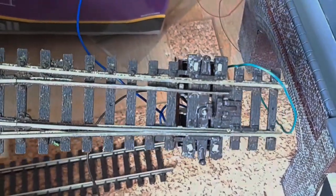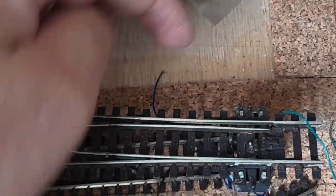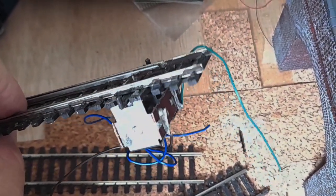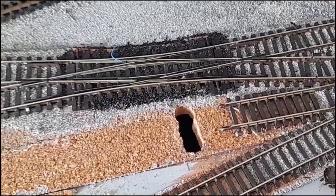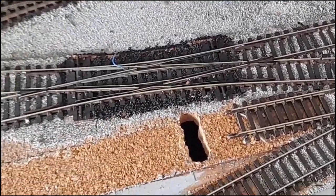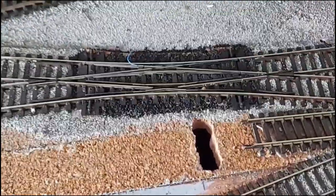As you can see, the pin is in the centre of the tie bar, and either side of the point you can see the four lugs which hold the motor in place. There are a couple of pins on each side which are just folded over and hold the motor nice and secure. Add your wiring — which I'll show you in a minute — and then the best bit is drilling out a big hole. As in the good old days of Blue Peter, here's one I made earlier. We have the hole ready to receive the point motor — this is just crudely done — the hole has to be rectangular and mount the motor perfectly.